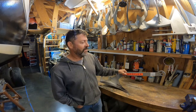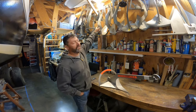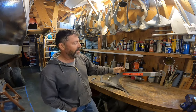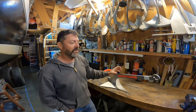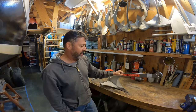In terms of the shank strength, I'll mention that I did bend the shank of a 304 stainless steel Quickset 22 anchor. The vertical height of both those shanks is similar, but I'll mention that the Ankerplex is a bit wider or thicker material. So let's say that this shank, while not the weakest of the bunch, is somewhere in the middle of the pack.